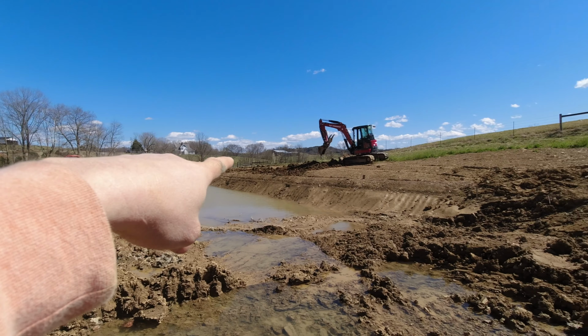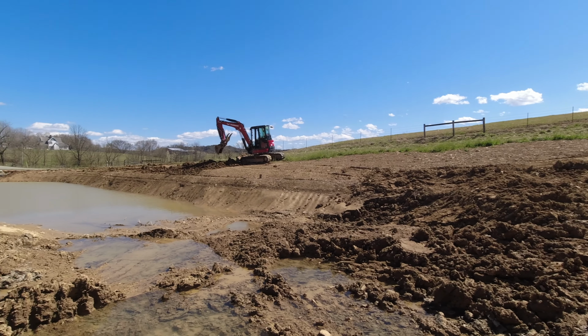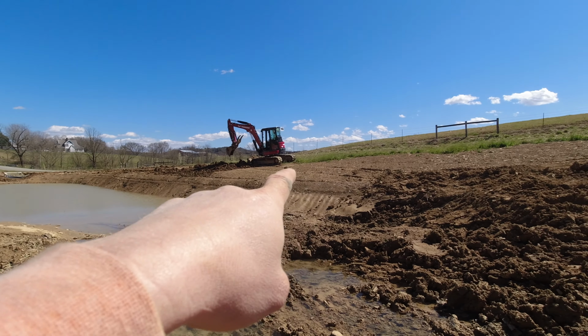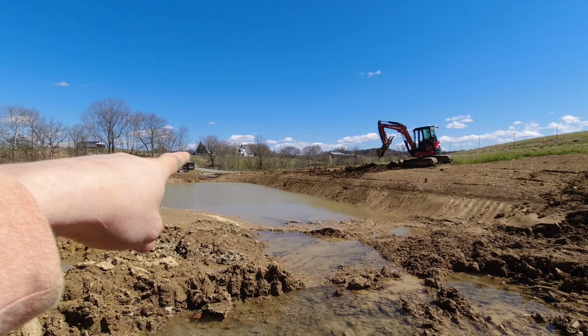So I'm going around through there. I've stuck some little old rocks on that water line because I can't see it from the machine. But I'm going to go in there, cut that bank back, taper it to the road, and then move that dirt out there and build that up.